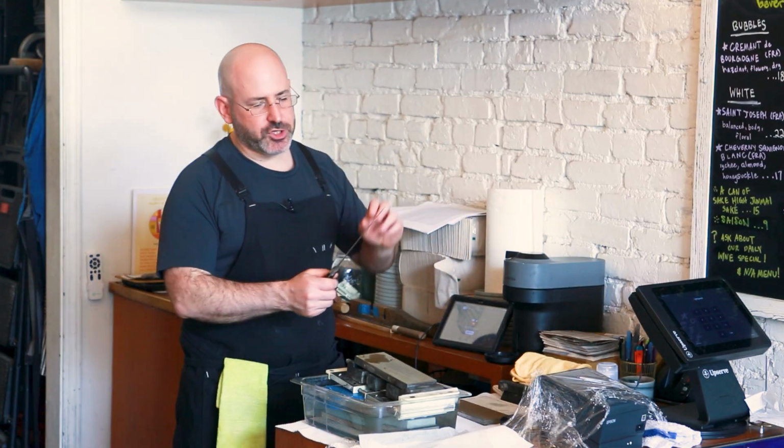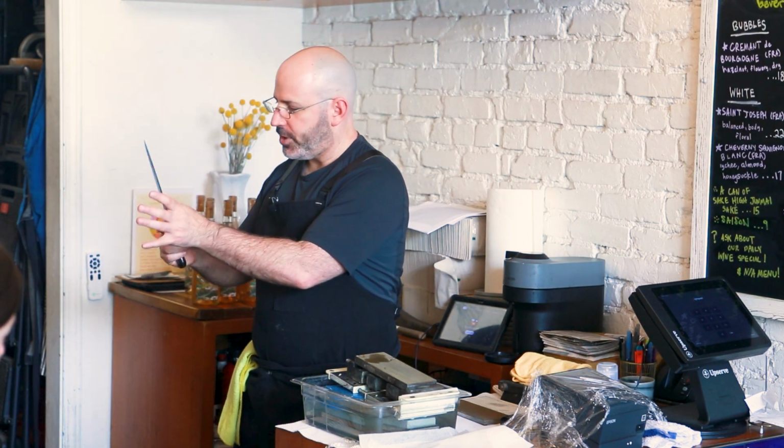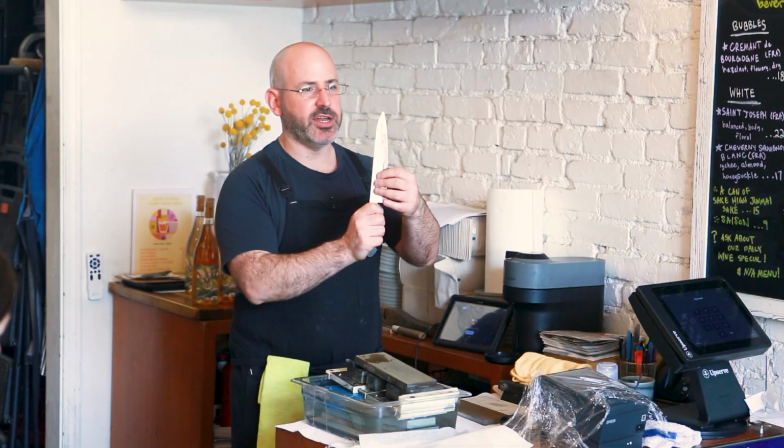We are going to use our index finger and maybe our middle finger, but our index finger is what's actually important because our index finger has more nerve endings than any other digit in your body. If we sharpen, for example, this side here, I'm going to place my thumb on the side that I sharpen, and I'm going to take my index finger and my middle finger and run them along the edge of the blade like this. I'm running them along the side. I'm not running them over the edge. I'm sure as hell not going towards the edge, and I'm not moving laterally at all because I don't want to cut myself. So, again, I'm going to feel all the way through from the heel to the tip.